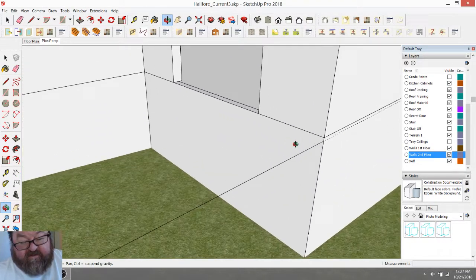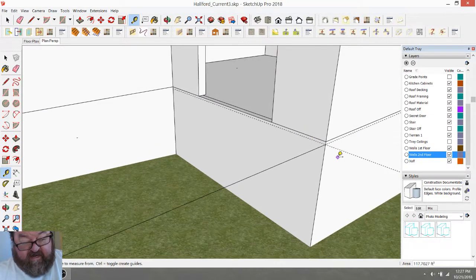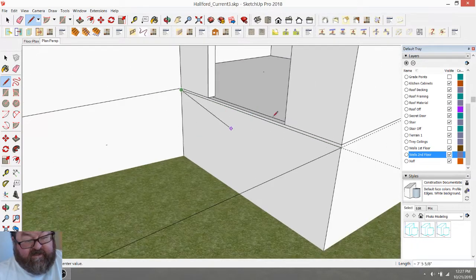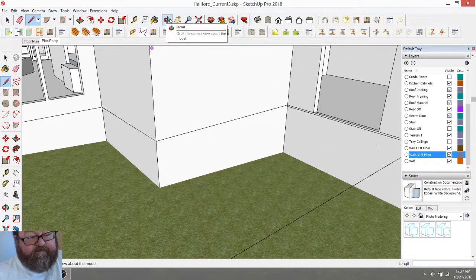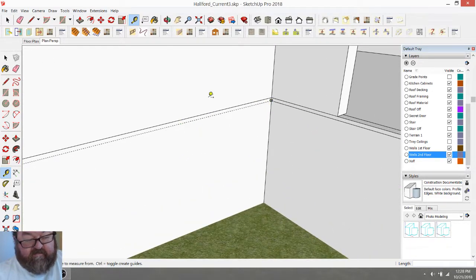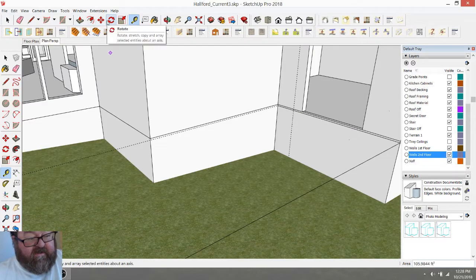And I was just getting ready to start putting some lines on here for the patio. I like to put the patio down at least 1.5 inches, so that as you get rain, it doesn't blow in under the door. So what I'm going to do here is I'm actually going to come back. I'm going to leave a 2-foot landscape border here. And this is the other thing I like about this idea. I'm going to move this door over.